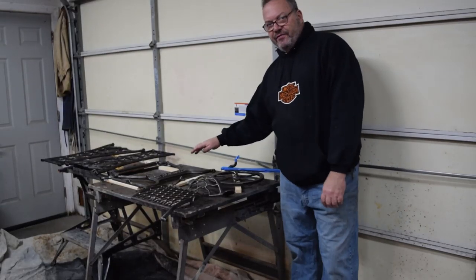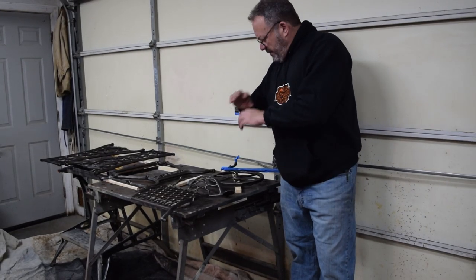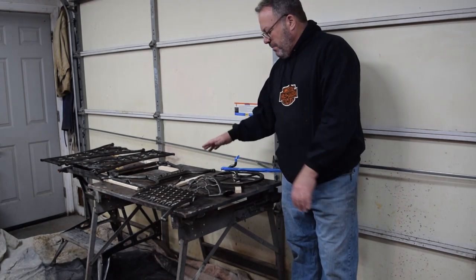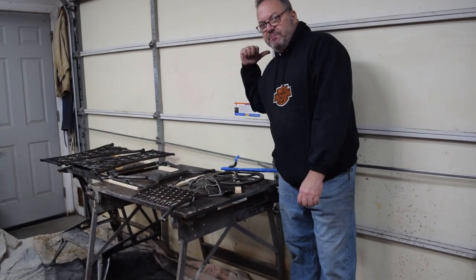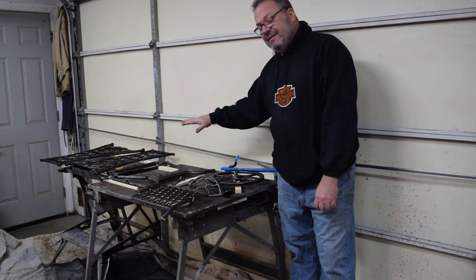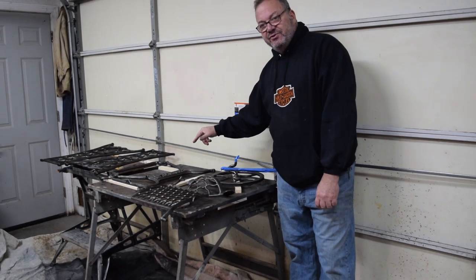Okay, all the cast iron pieces have been prepared for paint. They've been wiped down with acetone. I've got them up on some blocks here. The big issue is it's pouring rain outside, and it's supposed to rain for the next couple of days. So I want to get some paint on these because I don't want them to flash rust on me.